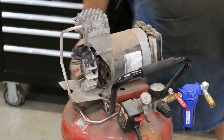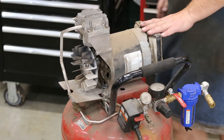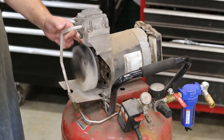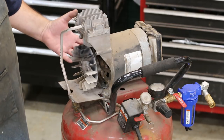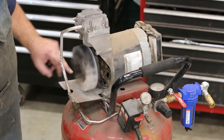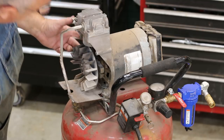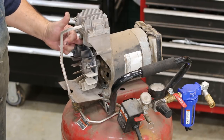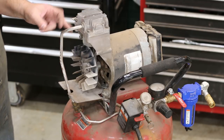It's got spiders inside and everything. When you get in here, I can see the piston is intact. A lot of times on these, the piston will actually break, and it's really easy to see when that happens. I haven't had this apart yet, but I still suspect that my rings are bad. It's a very common failure — you'll see the piston break on these. It's the same process to replace it either way.